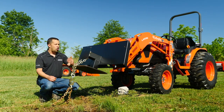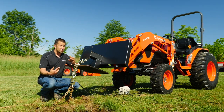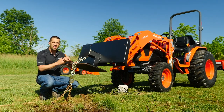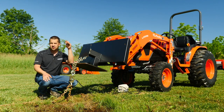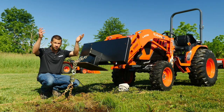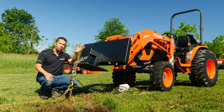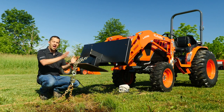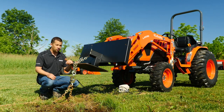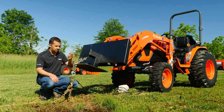When you look at a tractor spec sheet, you're going to get two measurements. You're either going to get pivot pin, which is measured back behind the loader coupler — it's a good marketing number because it gives you a big number, but you don't actually lift anything from that pivot pin point, so it tends to be an inflated number. If you base your purchase decisions off of a pivot pin measurement, you may be disappointed when you go to lift that amount of weight and load it into a truck. The more honest measurement is bucket center, which moves that measurement point out to approximately where the middle of the bucket is going to sit, usually measured at 500 millimeters forward of the pivot pin. We're going to measure from bucket center.